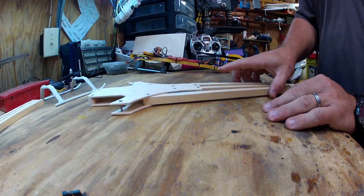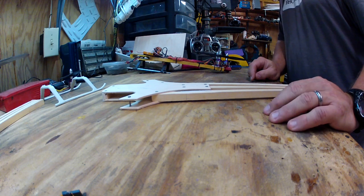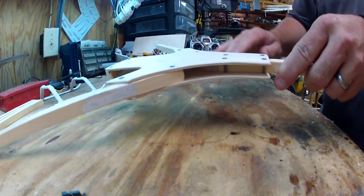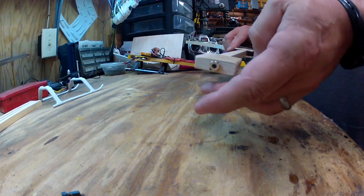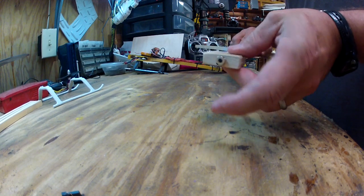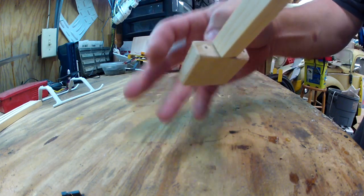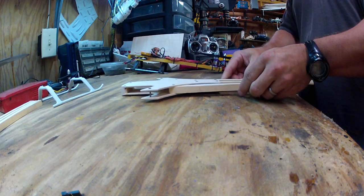After getting a lot of requests to build frames, I warned folks but they said they don't care. So I started building some frames. These have improvements over the old ones: all flat screws so your velcro isn't fighting a bump sticking up. I've also gotten a drill press so everything is straight. This is basically a fiberglass four-millimeter rod with a collar — not loose or wimpy. There are two holes drilled in it, one closer and one farther, so depending on whether you have a long or short servo arm, you can adjust how much it sticks out. It does fold.